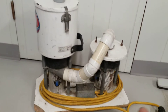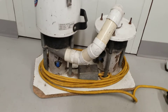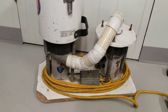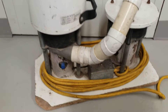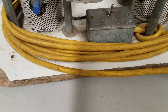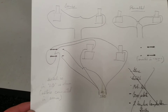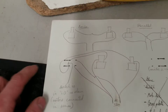It would also give the machine a low speed, because when you're taking your vacuum into somebody's house to unclog their system, you're probably also going to go down and clean the filters on their power unit. Your service vacuum is multi-function, so you don't need 270 inches of water lift to do that. So I did end up making a low/off/high switch.